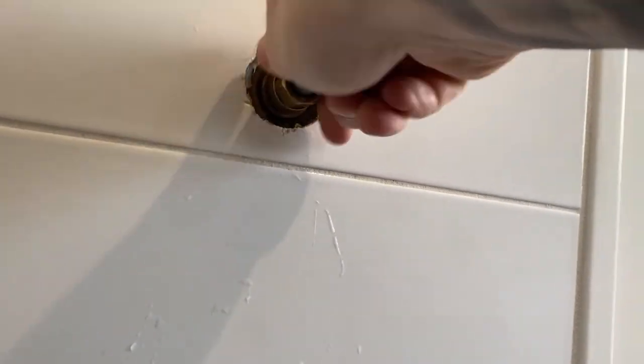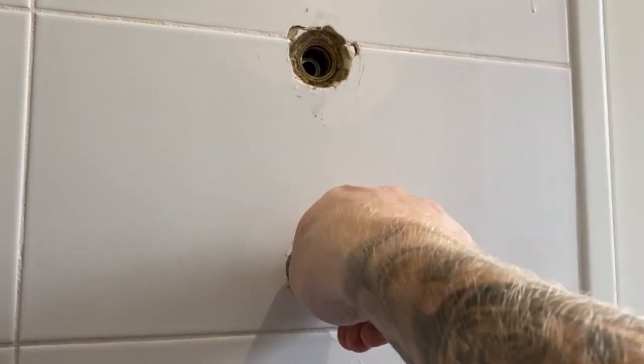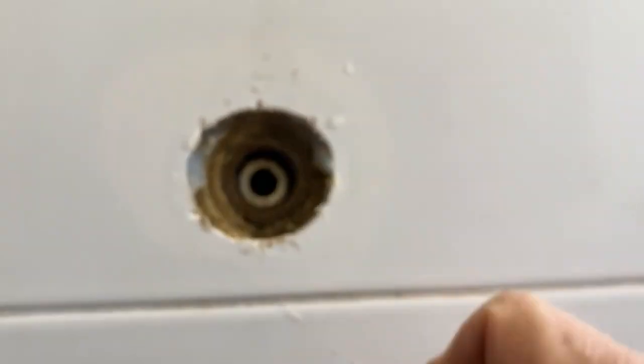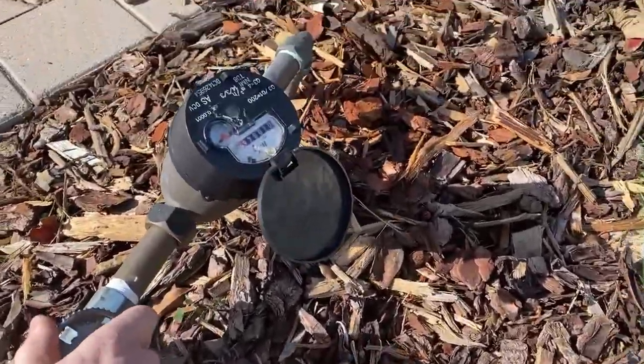What I'm doing here is reseating the in-wall set. When we replace taps, we reseat. If I take the reseat out now, you can see that the seat inside the wall is nice and shiny now, whereas it was dark and used before. So both spindles have been reseated.